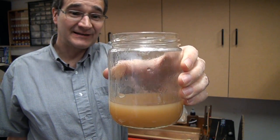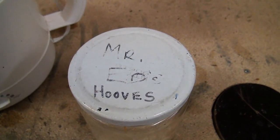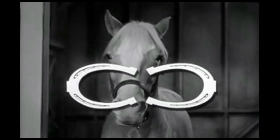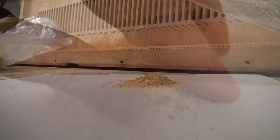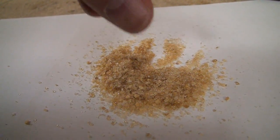So what is hot hide glue? It's good stuff, and it's exactly what its name is. I have always had a name on it called Mr. Ed's Hooves. However, it is really not made from horse hooves, or it would be called horse hoof glue. There is also fish glue, and that works too. Hide glue is made from the hides of animals — a process where the skins are generally cooked in water, and the residue from that is dried into these crystallized flakes or grains.